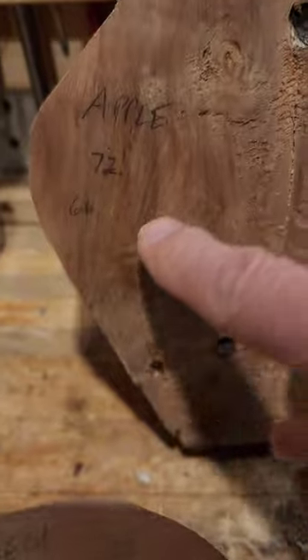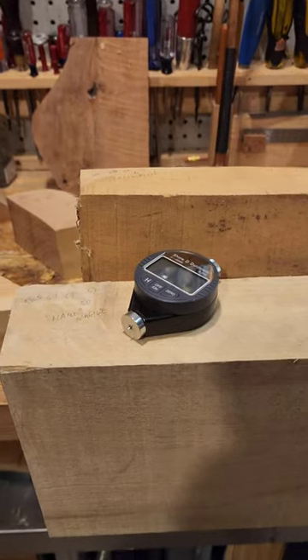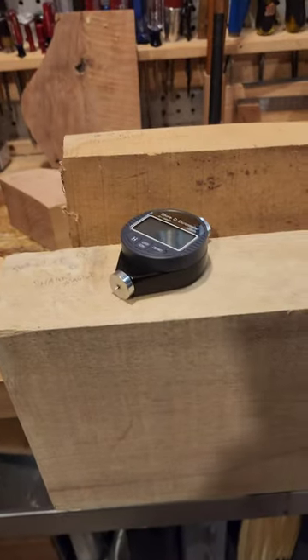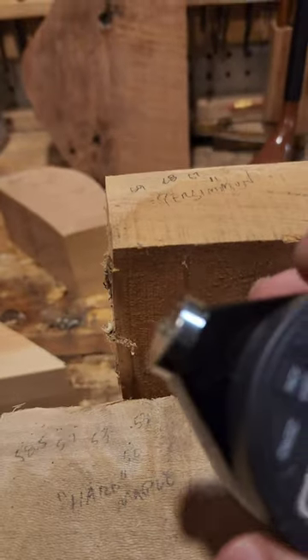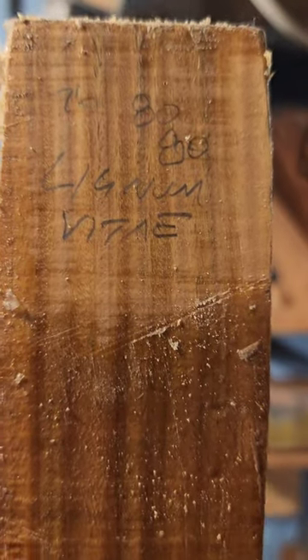Persimmon I'm getting 68, 69, 71. Beech is also very high numbers. I think anything above 65 isn't denting. Apple is 66 to 72 depending on where you measure it. Pear was 67 to 70. Dogwood 72 to 74. Pine was 41 — yellow pine. Hickory is a hardwood, getting 72 to 73. And lignum vitae, one of the hardest woods, I'm getting about 76 to 80. I think this meter is something you could bring to the lumber yard — even for flooring, which needs to be hard to resist indentations. Just don't let them see you creating pock marks with your meter.